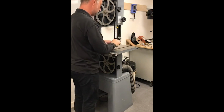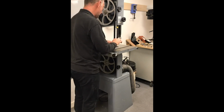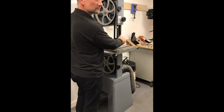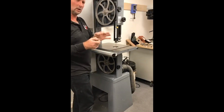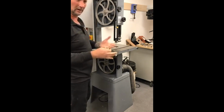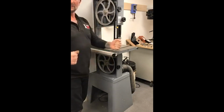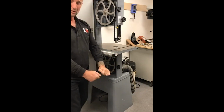So first up, when you're unfolding the bandsaw blade, is it any different for a 3/4 inch blade? Bit more resistance. I'd probably wear gloves, because generally they're coarser blades and they bite a little bit more. Gloves are wise. I've been doing it a long time, and I'm really quite used to it. Bit more resistance, but still keep your hands low and you can control it.